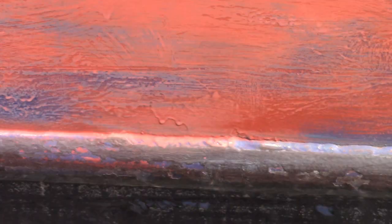I'm just going to do a little bit more rubbing down in one or two areas with a rougher paper. I started with 240, quickly changed to 180, and now I'm going to go back to the 240 grit just to tidy up one or two bits. This is the sort of thing that needs tidying. You can see the runs there, they're still slightly raised.